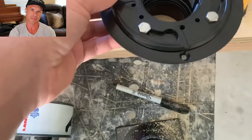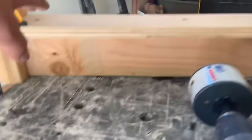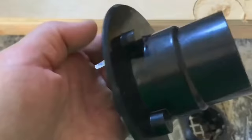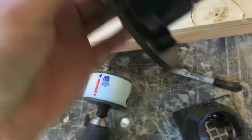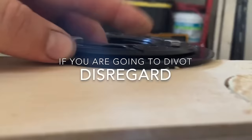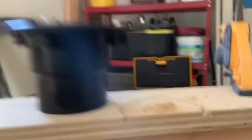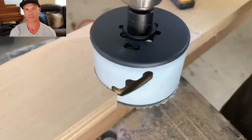So I got my shower drain base marked and started making the cut here. I got this set up so it'll be full on each side, and I'm going to end up cutting this off so you'll be able to see the entire side — the mock-up. You'll see the pre-slope waterproofing and exactly how I build it. The clamping ring has these plastic hubs that it goes into, and most drains will have this. The issue I see most is GCs and plumbers cutting out past this to get the drain base to sit flat on the subfloor. You don't want that because your tolerance of your deck mud can't go down to that eighth or quarter inch. So you get a three to three-and-a-half inch hole bit and cut out just enough material for the drain to slide down through and rest on those nubs. That gives you your half inch to pack your deck mud up under it.